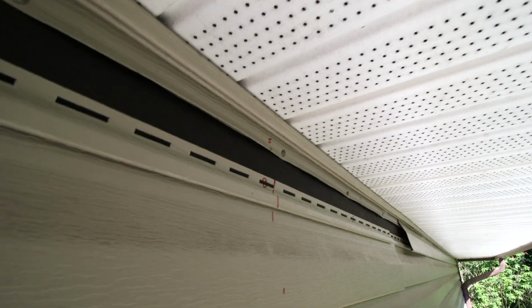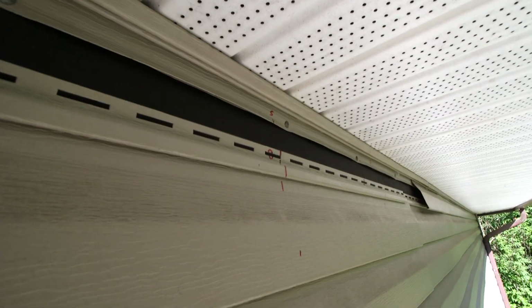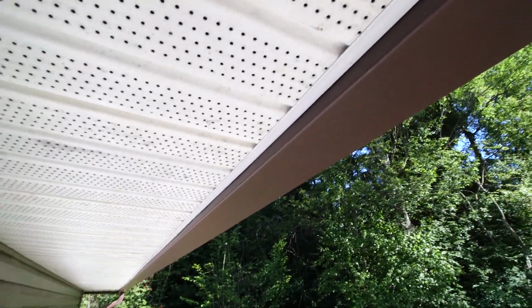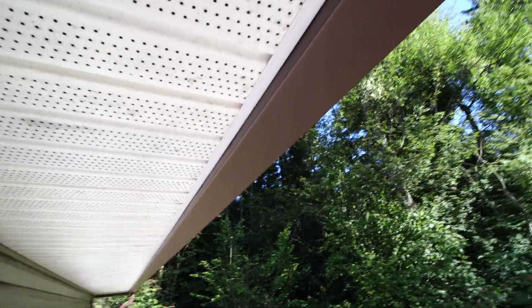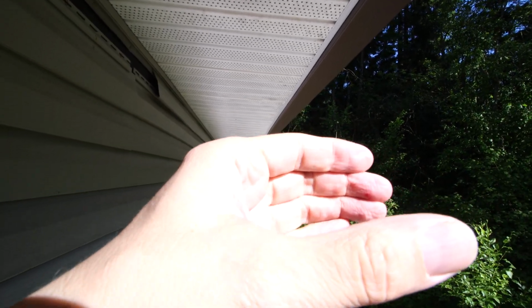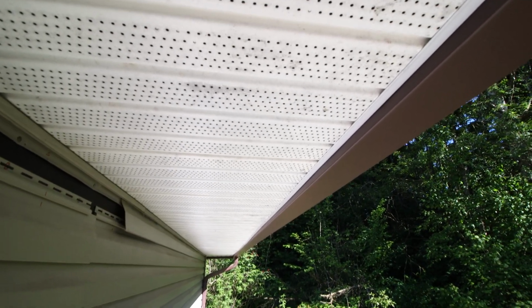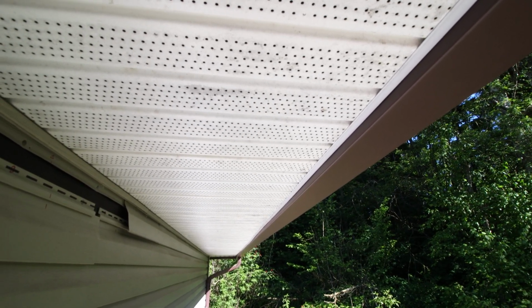And then what I'm going to do is take some cold rolled or something like that. I think I might have some rebar or something like that in the shop. And I'm going to make a tripod structure that's going to go out to the edge of the gutter here. And there'll be a cup that sticks out, and then the mast will slide up into that cup, and then I can lock the cup so I'll have a bolt that goes through the end of the cup, not through the mast, because I don't want to weaken the mast.